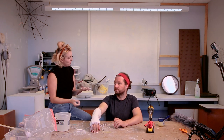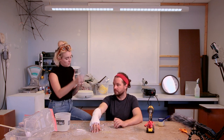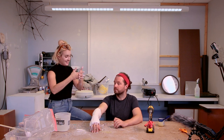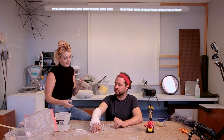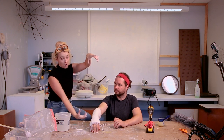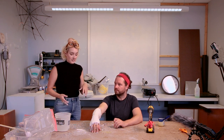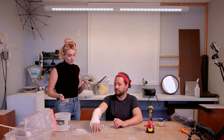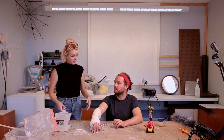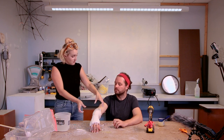And then right before you take the two solid halves off of each other, I usually use a Sharpie. I'll draw a couple of lines so I know where they should connect back together. Then I'll try to draft both sides off in opposite directions and put them back together. Every once in a while, especially when you're starting out, you might not draft it perfectly on halfway points, so you might have to flex your plaster a little bit.